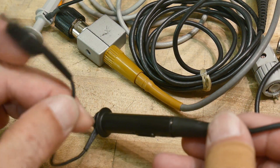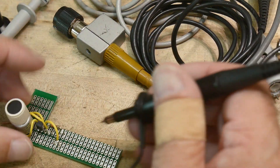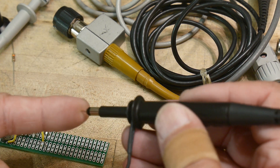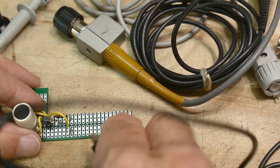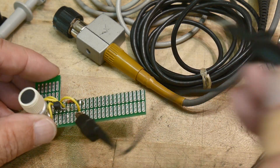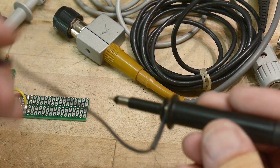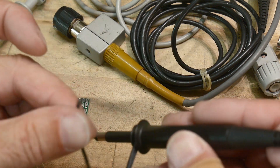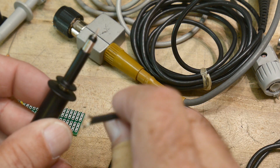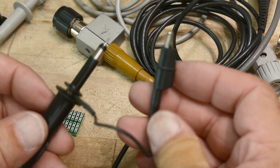What's this wire on the probe? This wire is a ground wire - it's connected to ground. A voltmeter has two wires and you're always measuring with two wires, but an oscilloscope probe only has one. This ground wire is the other connection - you have to find where ground is in your circuit, clip it on, and then you have a completed circuit. There's a little alligator clip and it connects to the scope probe with this little wire. They're stuck on by a little metal clip that snaps onto a ring.